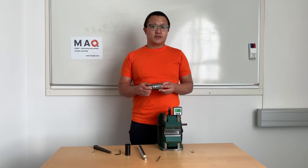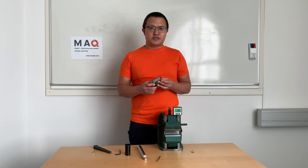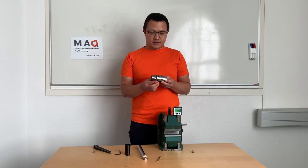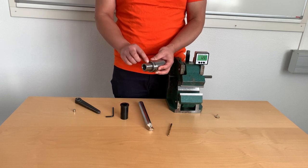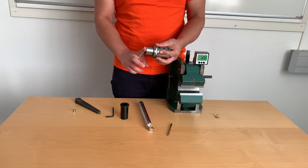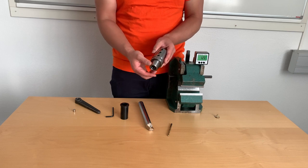People have also been asking us about multi-tasking machines where they can't find any surface that can be identified as the moving axis. In a typical multi-tasking machine, you have a modular clamping system — for example, a PSC 50 or Capto C5 clamping interface. You can see that in the interface there's a hole in the middle, which is used to indicate where the tool should be aligned or referenced, and this is also the same direction as the clamping screws.